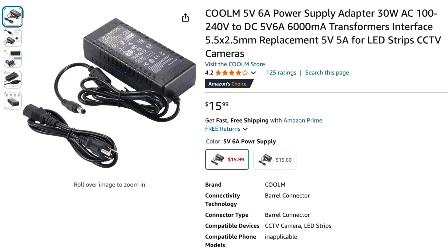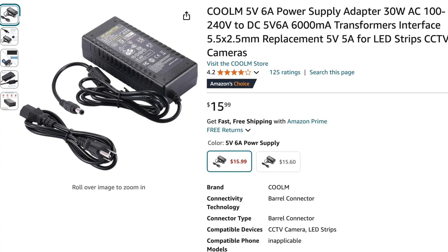Second, there's a variety of different power supplies from different manufacturers, and some of them are better than others. Some of the earlier ones were four amp power supplies, which sometimes isn't enough, especially if we get into overclocking. I actually had one of my four amp power supplies fry on me when I was pushing one of my Supras — it died and I had to replace it with a six amp power supply, which has been much better. I've noticed a lot of manufacturers now switching from four amps to five or even six amps.